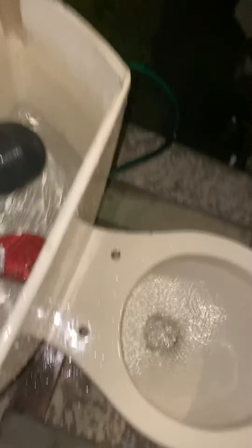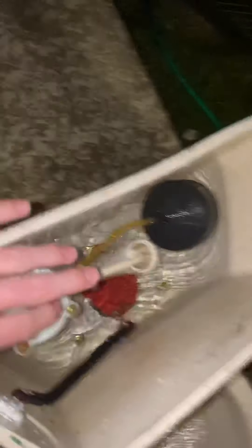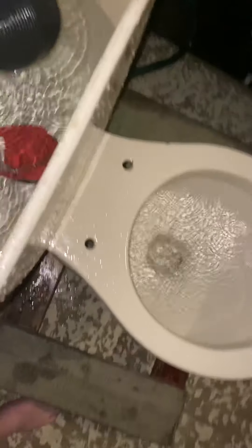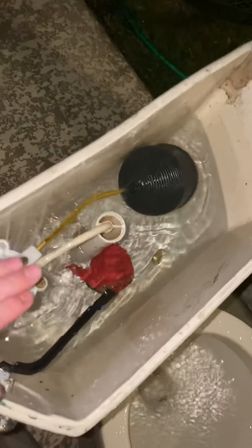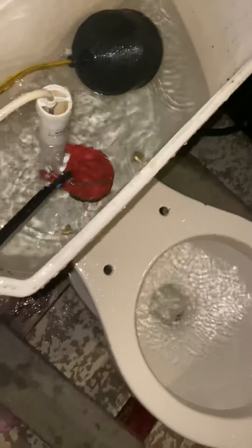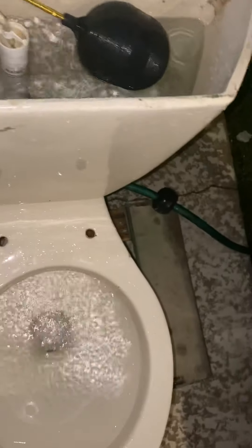This is my favorite version of the Wellworth, to be honest. It's got this fill valve — I really like these older style fill valves better. Actually, this is not the original fill valve. A lot of people say Kohler at the time used Fluidmasters, but they actually didn't. I know they didn't, because when I got my 1990 Kohler Wellworth, and I've seen many Wellworths from this time, they all had that same fill valve — they all looked exactly the same. So this is actually what they originally used.